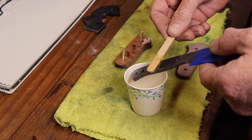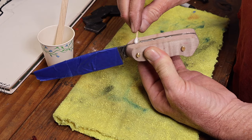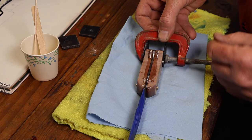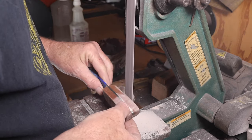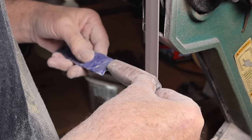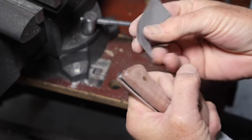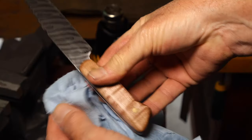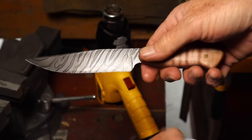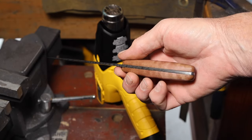It was time to get it all glued together. Used 24-hour epoxy — got it all fitted up, put together, and clamped up. Cleaned most of the epoxy off with some WD-40 and Q-tips, then let it sit overnight. Then it was time to finish sanding the handle — sanded up to 1,500 grit. Put boiled linseed oil on it just to bring out some of the grain, finished that up with carnauba wax on the handle, and just hand buffed that out.